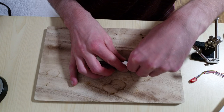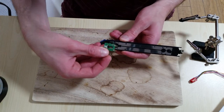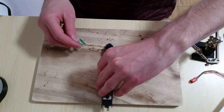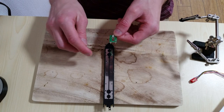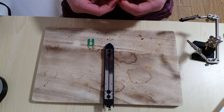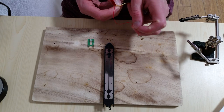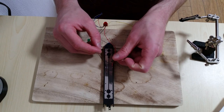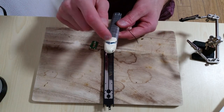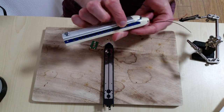I'm going to carefully pop this light board out — it just slides out of this little plastic piece. Now, remember this is going to be the front — right now it's backwards for me. The decoder will be installed with the red wire on the right and the black wire on the left. I'm going to trim this wire quite a bit because I'm going to try to hide it all up in the front part, underneath the crew cab area, so the decoder and everything will be hidden inside and you won't be able to see it when you look through the windows.